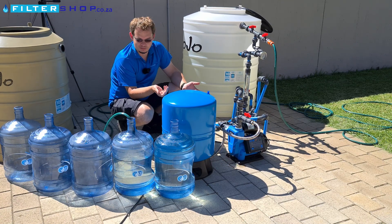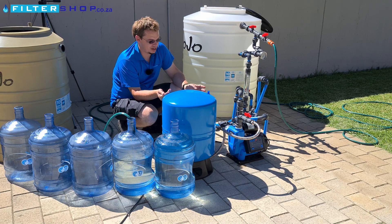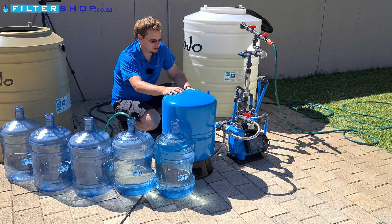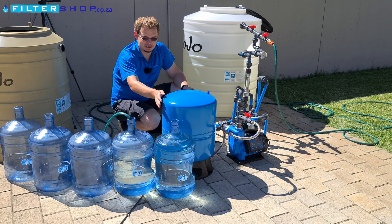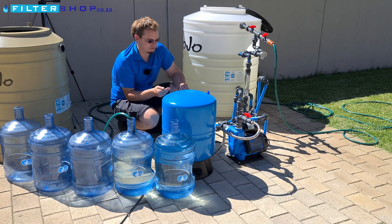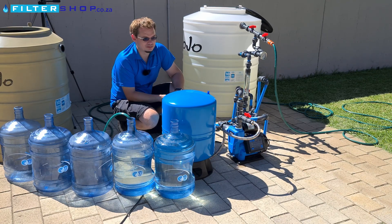The big reason you're saving power is that instead of the pump having to run beyond the point it can throttle, the extra power going into the pump is actually compressing the air in the tank. Whereas previously it didn't have anywhere to go — it was just lost as heat.